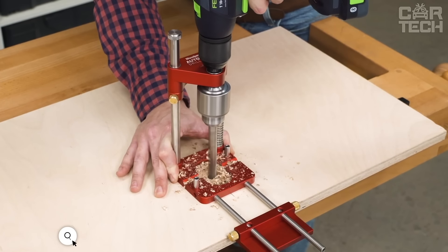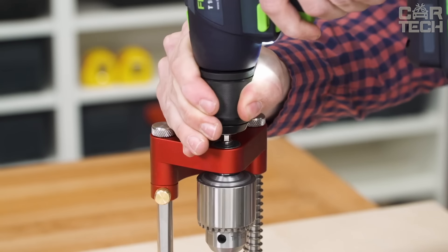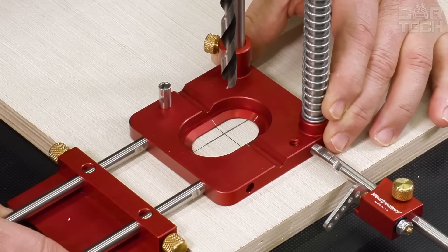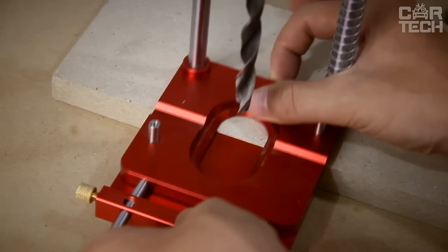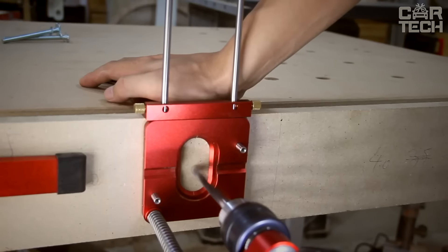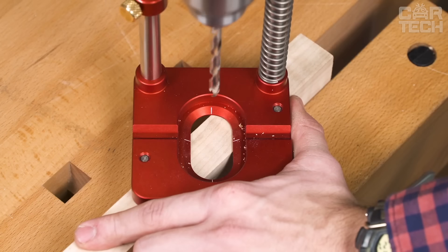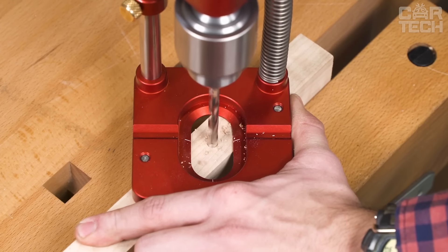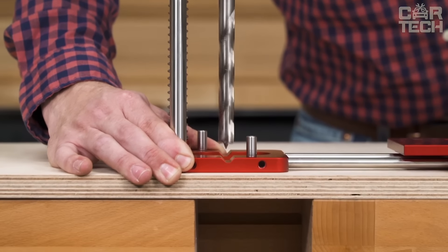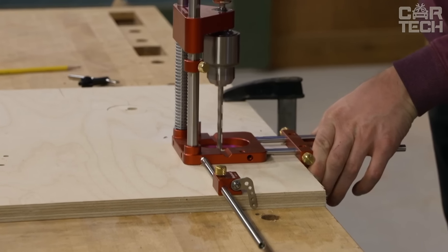The Auto Line Drill Guide keeps the drill perfectly perpendicular to the surface. It has a half inch chuck mounted on two ball bearings, and a base with laser engraved center lines — align these with the marks on your workpiece for a hole exactly where you want it. The base has a special V-groove for drilling round workpieces, and the kit comes with a centering pin to ensure correct positioning. It works with boards up to three and one eighth inches wide. The drill depth stop locks in place with a light finger press and adjusts to any position. Works with all drills, both conventional and cordless.